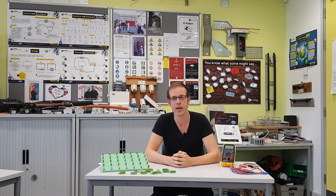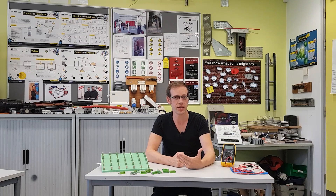We'll look at what happens when we connect two resistors in parallel with each other, then three resistors in parallel with each other. Connecting loads or resistors in parallel with each other is how the vast majority of circuits are installed. In the real world most loads are connected in parallel with each other, for reasons that we'll discuss in another video.